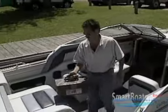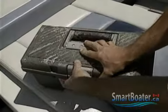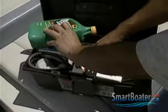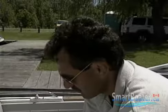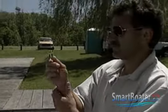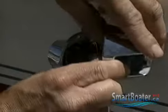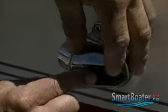The key to stocking spare parts is knowing your boat well and knowing what parts might fail. Unlike more mechanical things, an electrical failure is hard to predict — one day it works, the next day it doesn't. So boaters should carry a selection of replacement bulbs and fuses for cabin and navigation lights and electrical systems.